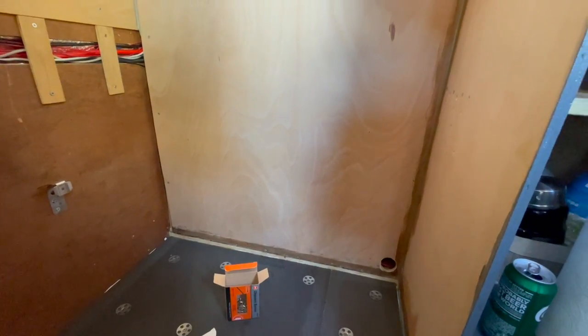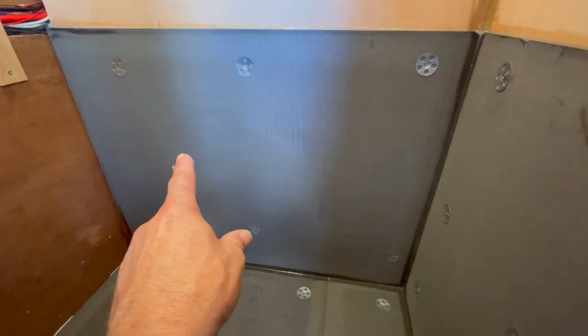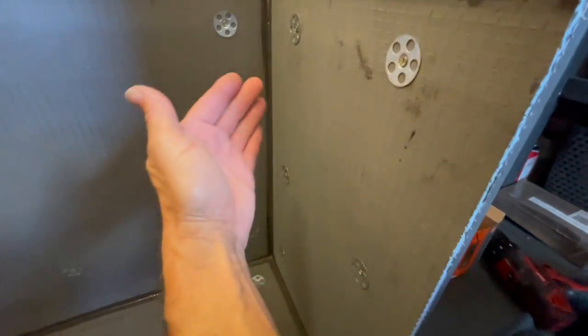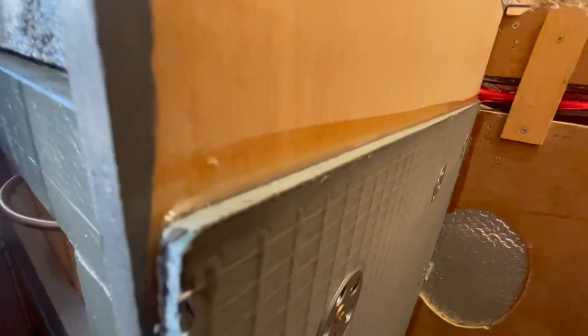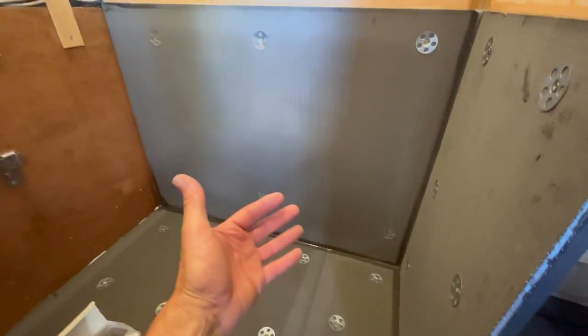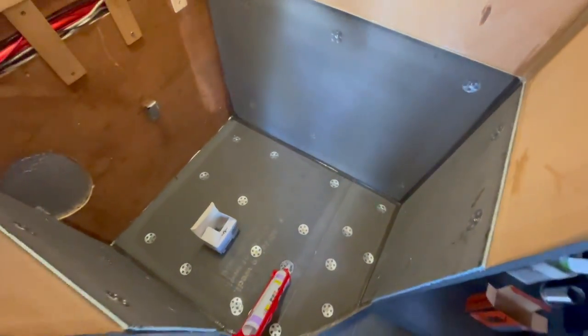Let's do that bit there first. I've done that side — this part here has silicone all behind it and the gaps are filled, so hopefully I'll silicone these on as well with some clear silicone along the top. You can see the silicone there — all around the back, all around both sides. Even if the tanking system was to let go, hopefully this should be completely sealed.